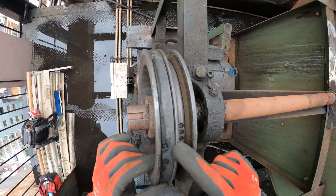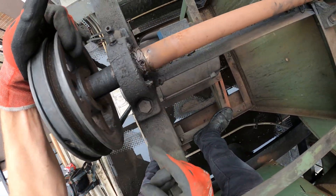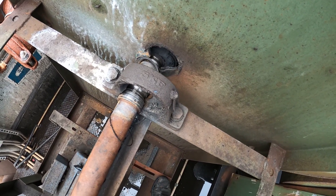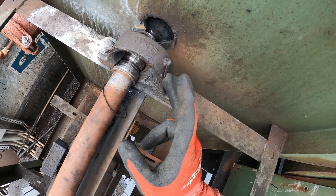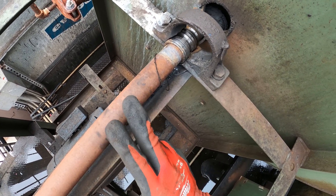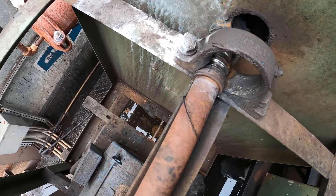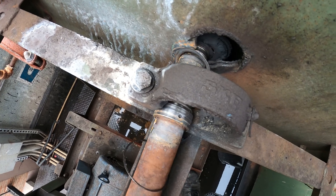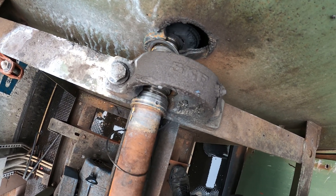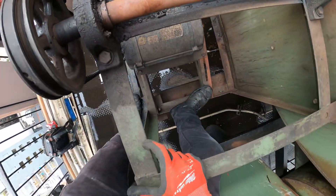This seems to be okay — this pulley. We need a new pillow block bearing here. Might be a good idea to change the shaft too, with it dug in like this. I don't hear any scratching on the blade. We gotta take a quick inspection of the blade — it might need a replacement. Wow, it's crazy.